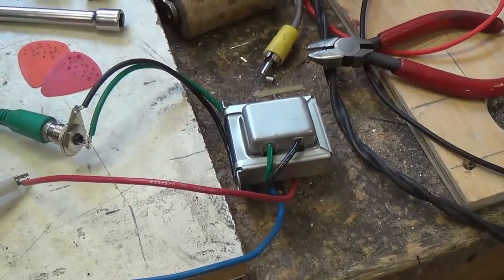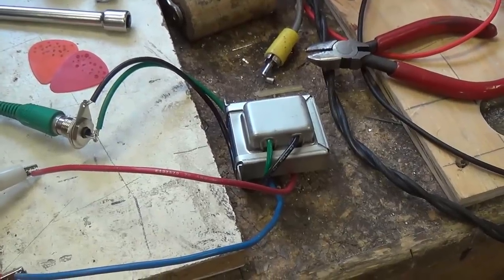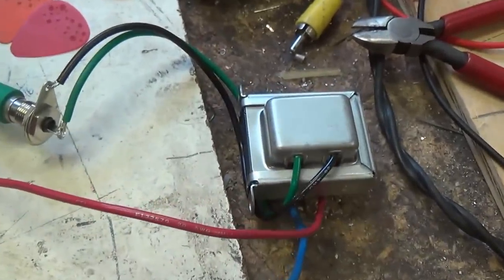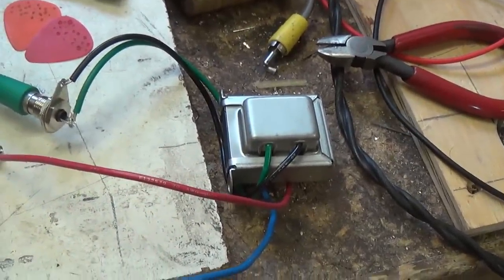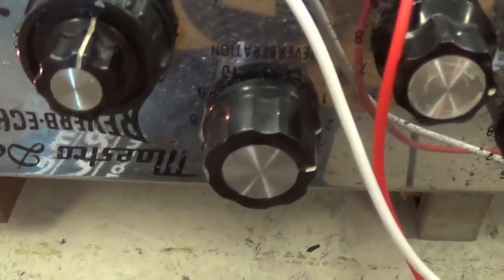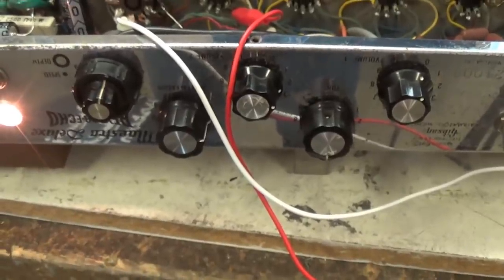You know, I'm really not pleased with the reverb in this amp, and they're supposed to have fantastic reverbs, and this one's very weak. So besides the new Accutronics tank that I've installed on the floor of the cabinet, I've also now inserted a Fender style tank driving transformer that's appropriate for the Accutronics tank that I installed. Let's strum a few chords and see how it works. We've got the reverb here set at about 1/4. I'm going to put the camera on the tripod and we'll see how it sounds.